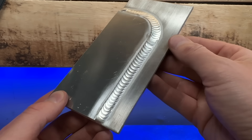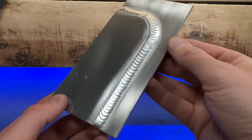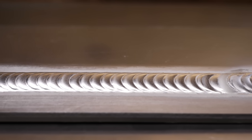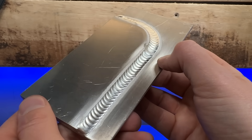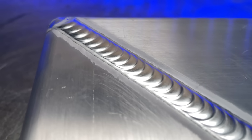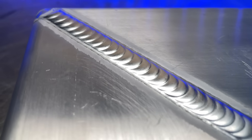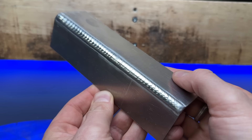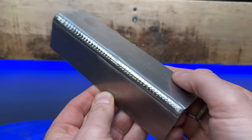When we are TIG welding aluminum, we need the perfect balance between the shape of our weld, good edges where the filler material blends and transitions into the base material, and especially with aluminum TIG welding, we want that finish. When we get all the variables balanced, we get the dimes that shine. This is what we want. And when I've been able to get my setup particularly dialed for some really good accuracy, I'm able to weld some really fine or thin material and get some really nice stuff, getting some smaller welds as well.